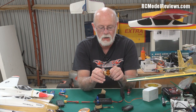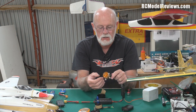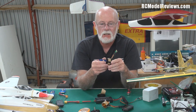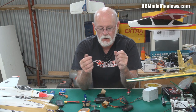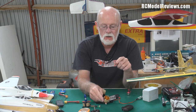I've explained KV, but I'm going to have to do another video where I'll explain the relationship between prop sizes, power, and current. To put it simply, KV is like the gearing in a car. A low KV motor is like first gear — you can drive very slowly but you've got a lot of power, you can go up very steep hills. A low KV motor doesn't turn very fast but it will turn a much bigger prop with a lot of torque. A high KV motor is like driving in top gear down the motorway — it doesn't have much torque, you can't spin the wheels, but you can get an awful lot of speed and a lot of RPMs.